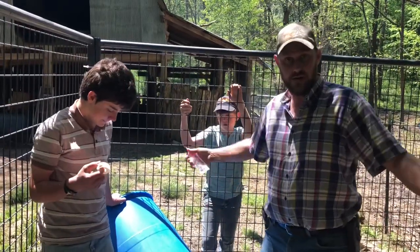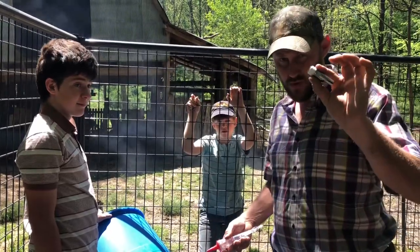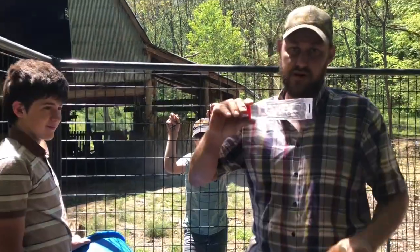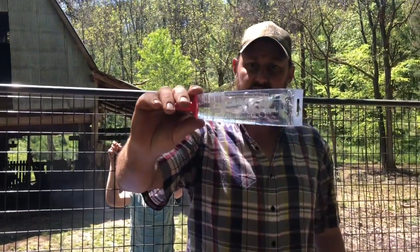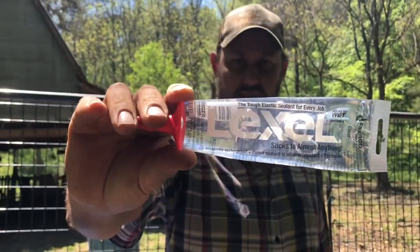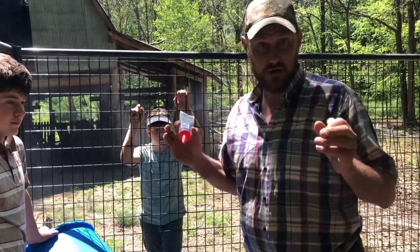We've got leakage. We had two of them leaking — one leaking moderately and one leaking severely. So the one that leaks severely, I rewrapped more Teflon tape and I've got Lexel here, which I use in my roofing. That is a very strong, very good elastic sealant. It is not a silicone and it sticks very well. Silicone doesn't stick to much of anything — it won't even stick to silicone. So Lexel is very good.